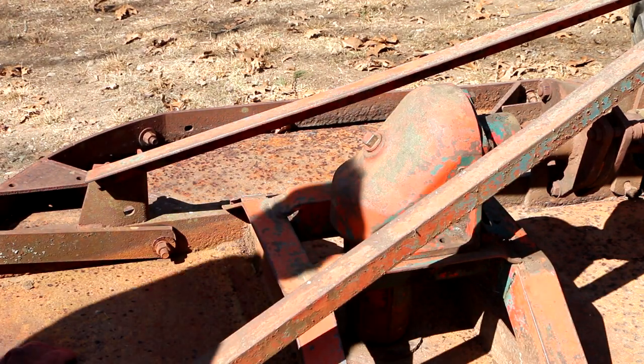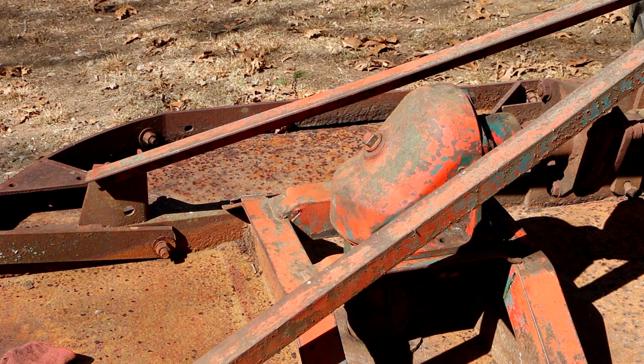Still a little low, but I'm out of oil. That should be enough for the test. The bottom bevel gear is completely submerged, and the other bevel gear is a third submerged, so as it rotates, it'll distribute the oil. Again, this is just going to be for a short test.